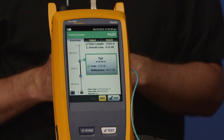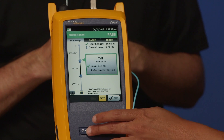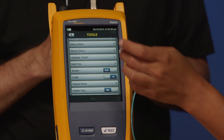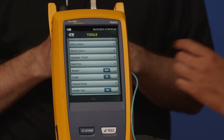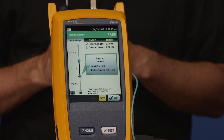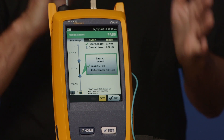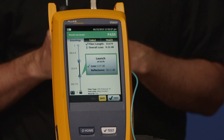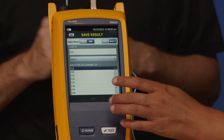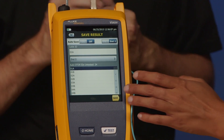For those listening to this accent, you can probably tell I'm not from America — I'm from the UK, and being from the UK I've set the unit to meters. I know you want this in feet. Press the home key, tap tools, and swipe up to where we see our feet and meter option. Press the home key and tap unsaved result — now our event map is in feet, everyone can relax. You can flip this between feet and meters, and you can also do that in the LinkWare software. We must remember to save the results — go ahead and hit save. There's my cable ID list confirming it's N2, 01A. Go ahead and hit save.